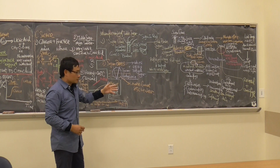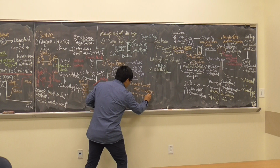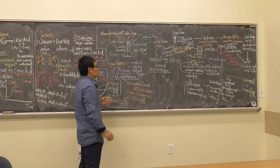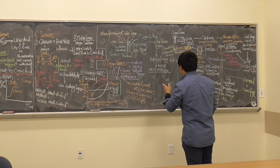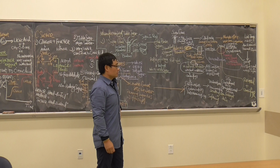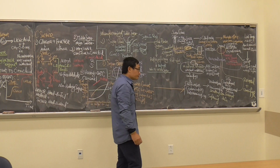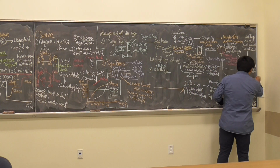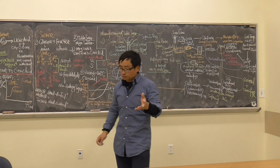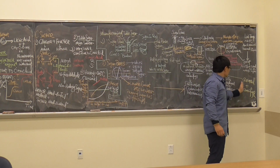The 85 degrees Celsius hot water could remove impurities and also act as a kind of diffusion. That means you make a juice. Then it goes to the clarification process. They have carbonization, decarbonization, then decoloration, demineralization, softening, and then crystallization. So at this step it is crystallization, not recrystallization. Then they do the centrifuge, and they will get white refined sugar, and the molasses could also come out, but it will be very minimal.